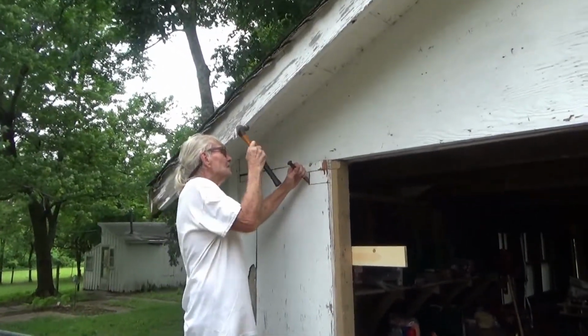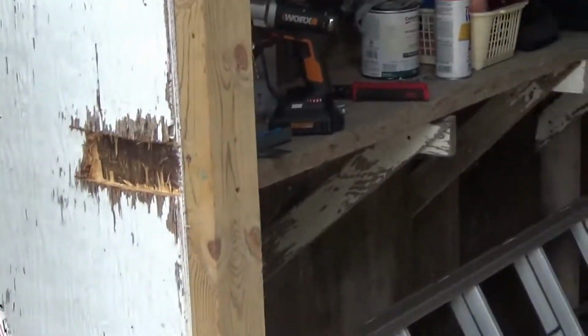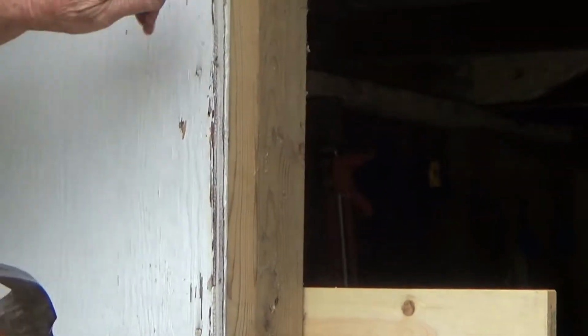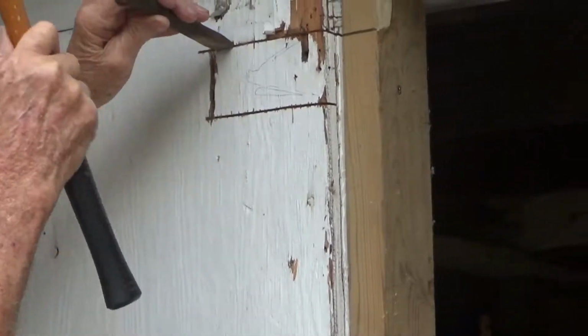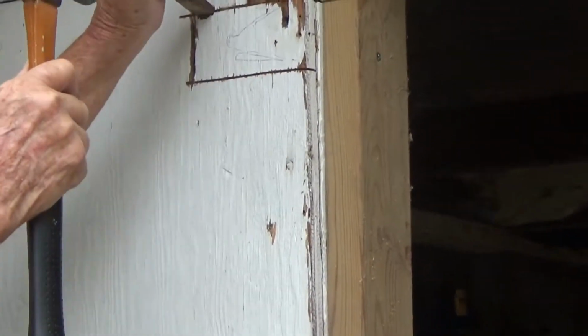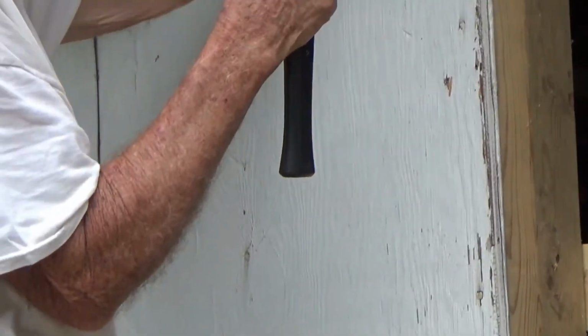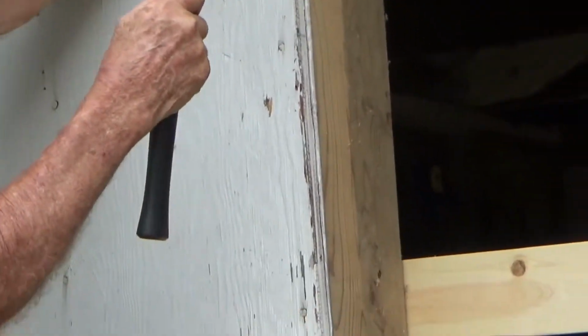To get the doors to fit, what Arvin did is, we're chiseling out the hinges, or the area where our hinge is, and we can go behind there and put a 2x4 in there to bolt them down. So we got a beam in there, and we'll put a 2x4 across the beam. And then we'll drill into the 2x4 from the outside.